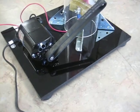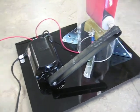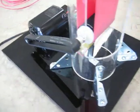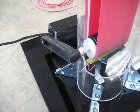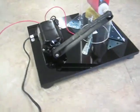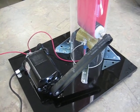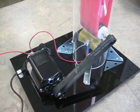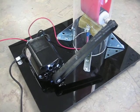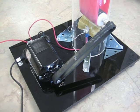This is a little document of my 350 kilovolt Van de Graaff generator — a fairly high current generator. It runs with a 3-inch wide belt, and these things push probably close to around 3,000 to 4,000 RPM using a 5,000 to 7,000 RPM motor. The newer motors will be pushing out closer to 6,000 to 7,000, giving it a slightly higher RPM after drag is considered.